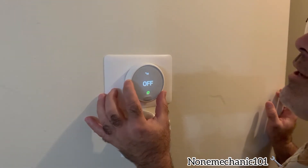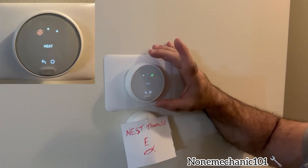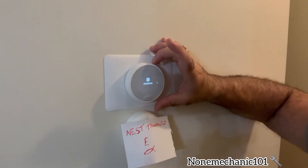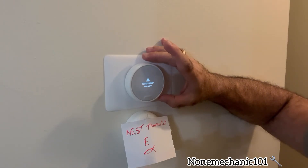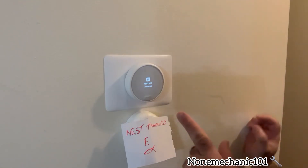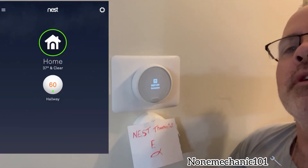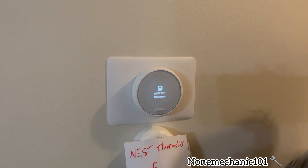We're going to press it in. We see 'Switch to heat,' 'Off,' 'Eco.' The round piece — press it and you see 'Schedule' again. Turn it like before and we're going to find anything that has to do with the app or the battery. And look what it says — the Nest app has been connected! What that means is that you charged the thermostat enough. It says 'Nest app connected.' So now go to your phone, to the Nest app, and see if you are connected.